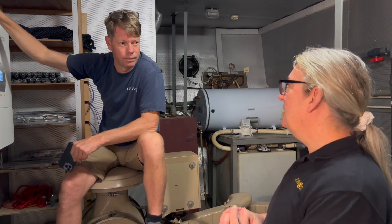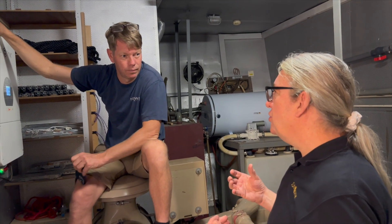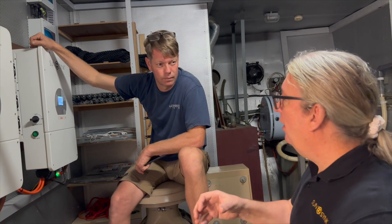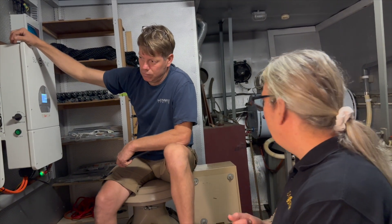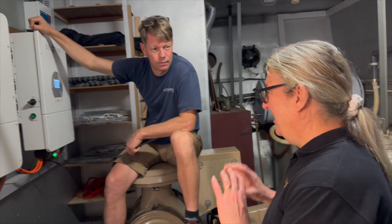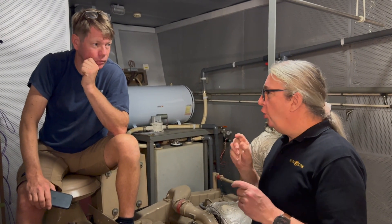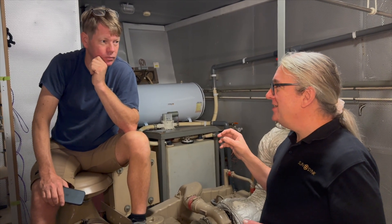It's something we can look at — we do have external switching now. Most people would use a generator to power the whole system, or use the ATS (automatic transfer switch) on the generator — but the generator must be big enough to power everything. Here you've got two inverters providing 17 kVA real — not a rated 15 kW that's actually 10 kW. That's a lot of power. If you pull off the genset it's going to draw 80 amps plus bypass, so possibly 120–140 amps at 240 volts — that's a lot of power to consider.